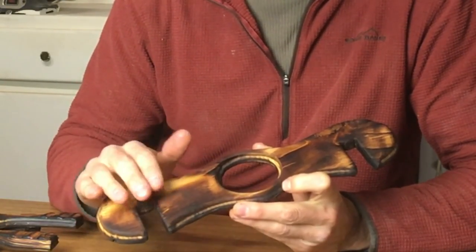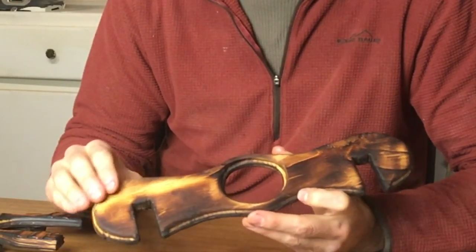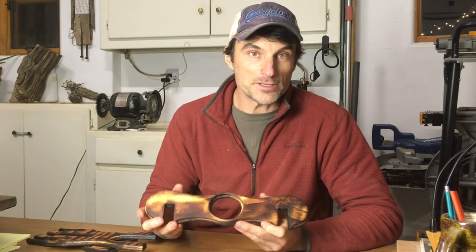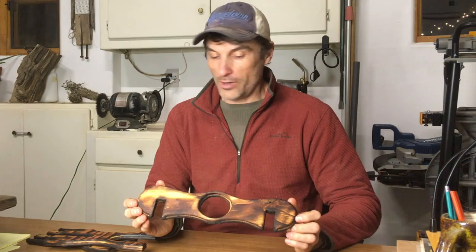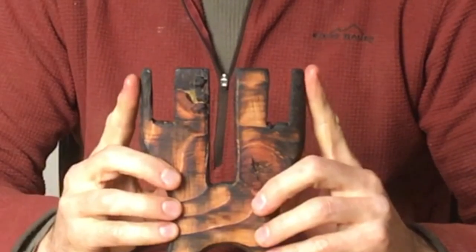If you want a multi-toned look on your project, make sure you burn part of the wood more heavily than other parts, and you can really monitor that through the burn process — start everything light and then pick and choose the areas you want darker. The tone, once you de-char it, is really going to come out once you apply the linseed oil; that process will help these colors pop and come alive, and you start to see the grain — plus the added benefit of your project smelling like flaxseed. I did not intend for these to look like castles, but there you go. One thing I would have done differently is widen these arms on the outsides a little bit; everything tends to widen out in the gaps after you burn them, after you router them, after you sand them.